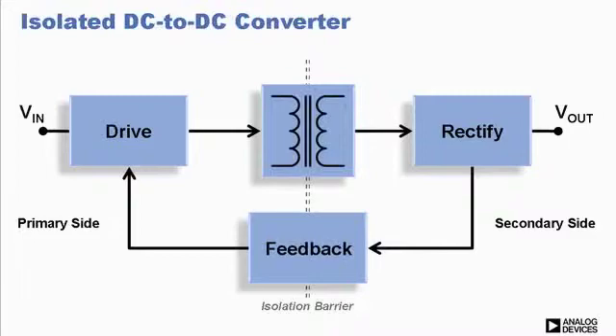You could use a linear regulator at the output instead of using feedback. However, active regulation with feedback produces higher efficiency, better response to variable loads, and allows for greater design flexibility.